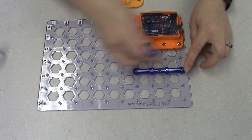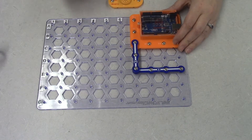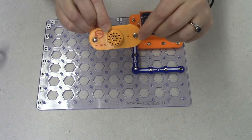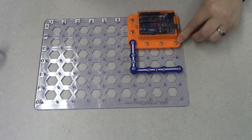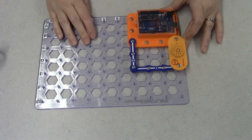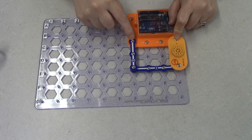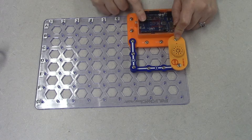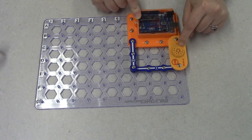We're going to connect this rail to ground to complete the circuit. The melody IC has a plus sign on one side — we're going to use the side with the plus, and that gets connected to the D11 pin. The other side goes along the bottom rail which is the negative, so you have the positive signal coming in and then it circles around and gets grounded to complete the loop. We'll put code onto the Arduino to send a signal to the melody IC for two seconds, then turn off for five seconds.